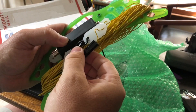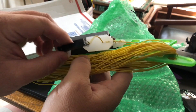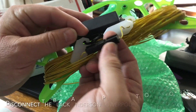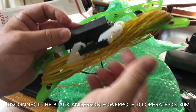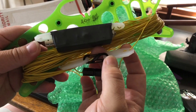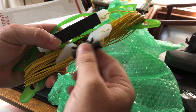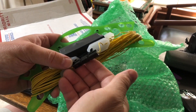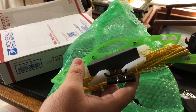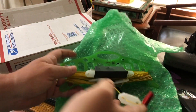I've got one of the models that handles up to 60 watts, and he included the 30-meter band in this one. To operate 30 meters, you just disconnect this Anderson power pole right here. You've got the antenna stretched out — a carabiner keeps the two halves together and takes the strain off the wire. Disconnect the black Anderson power pole and you're ready for 30 meters. Keep it connected and you operate 10, 15, 20, and 40. No antenna tuner needed — he tunes these to perfection.